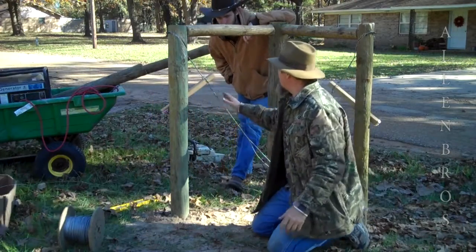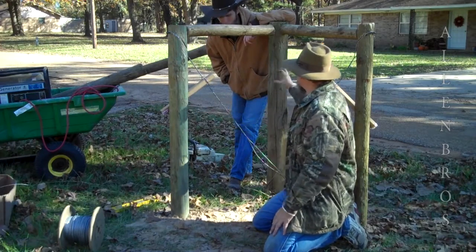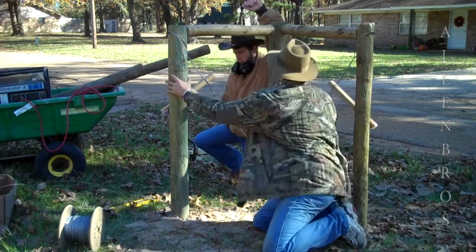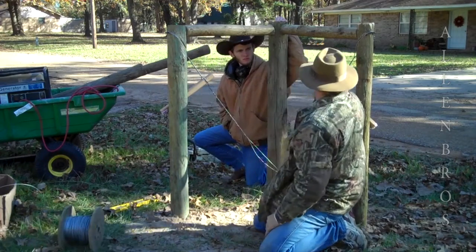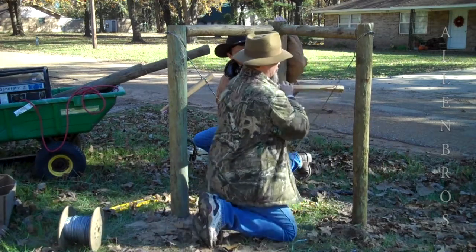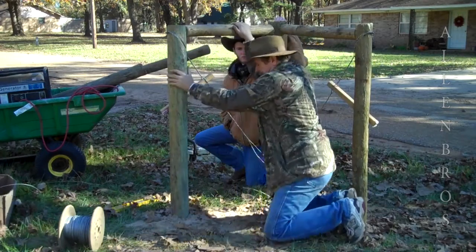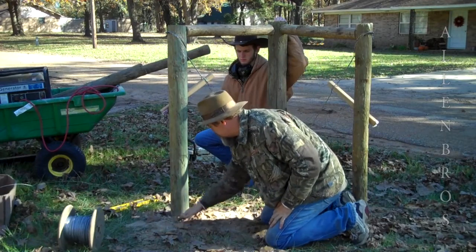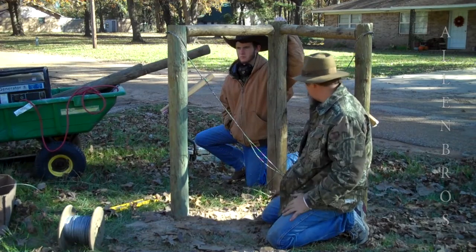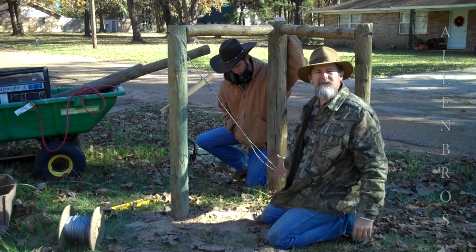Here it is. We've got our wire in. We used our two twitching sticks — we've got them on the outside because our electric wire's going to come through here, and we're going to use an acrylic disc, unless they have porcelain ones. You can already tell how firm it's getting — this one probably could come around one more time, but this side especially is firming up, and we'll come back. You can see where it's drawn up right here and it'll settle in. I've got my chainsaw lines off just a little bit — you don't have to do that. You can do it with just cable nails, but I really like to put the lines here and here, and I just angle the saw blade where I'm going.